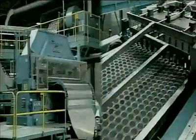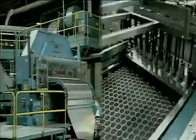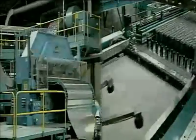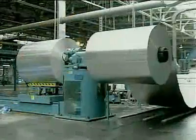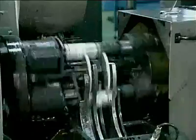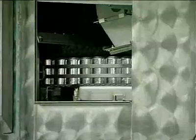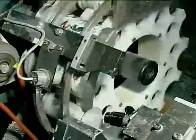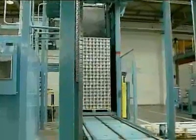The process involved in producing the finished can body is a two-stage operation, separated into the front end and the back end. The front end operations are coil handling, body forming, trimming and washing. The back end operations include coating, decorating, spraying, necking, flanging and finally testing and palletizing.